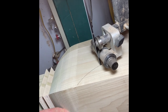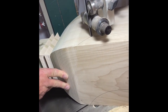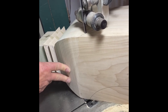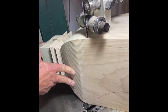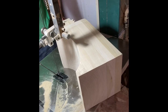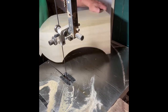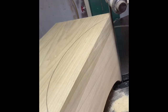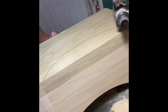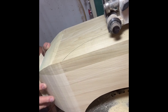That's really all there is to cutting a leg. It looks complicated but it's actually our quickest method of doing pedestals — turning takes us much longer. We like the way they turn out and they're actually a better seller than turned tables for us. We've dragged our feet on making a video and there's been lots of questions about how we cut them. That last side, along with setting up your bearings on the bandsaw, is the most crucial part. If the guides on the bandsaw are off and not lined up properly, your leg is not going to turn out the way ours does.